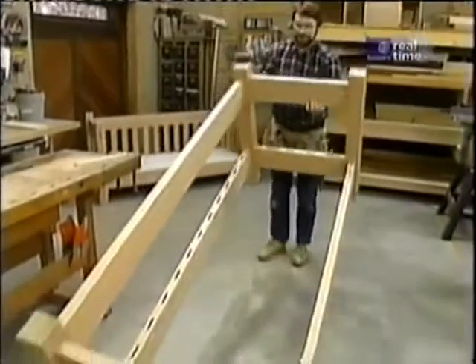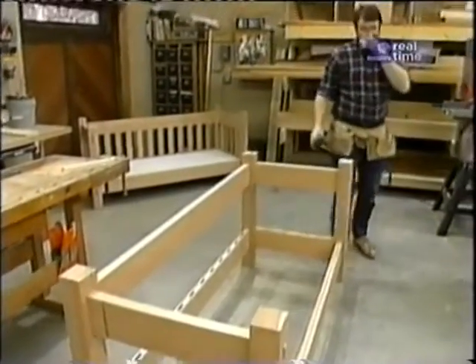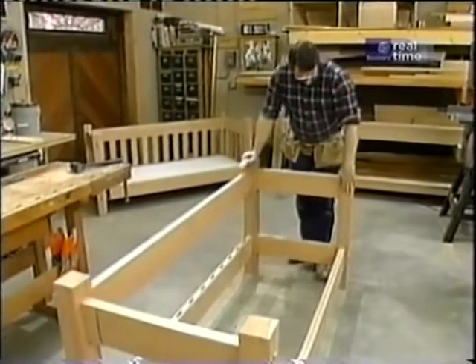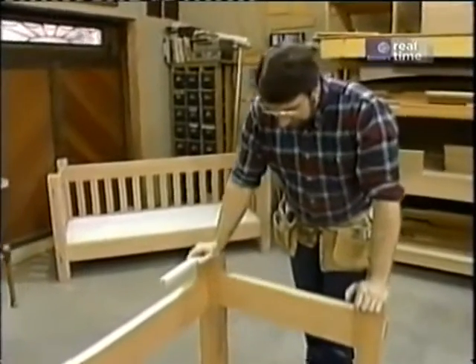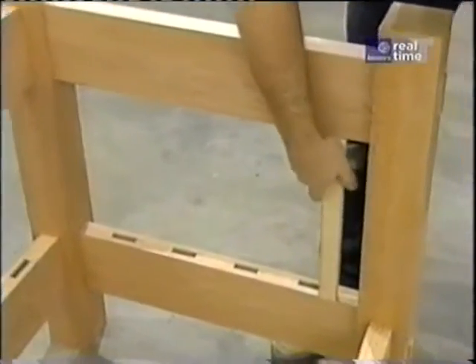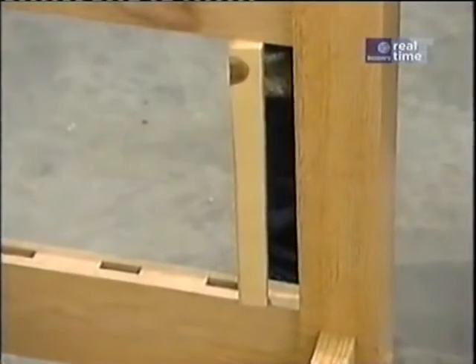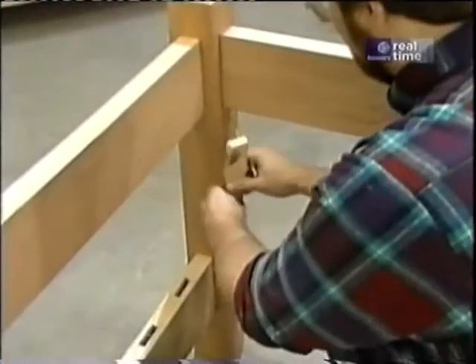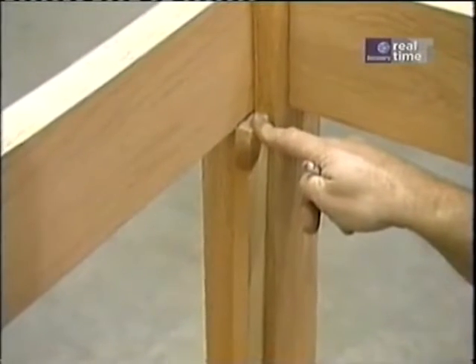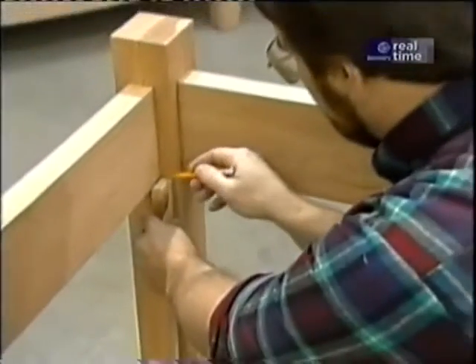I've finally finished making all the mortises for the slats, and this morning I started dry fitting the piece together. What I want to do is make sure all the mortises and tenons for the rails and posts are correctly made and fine-tune them. More importantly, I want to check the distance between the top and bottom rail. I made a little gauge stick which fits in this side — this is the side with the greatest distance between rails. On one end it seems okay, but over here it's not going to fit. I want all the slats to be uniform, the same size, so I'm going to trim a little off these top rails to make them consistent.